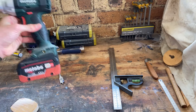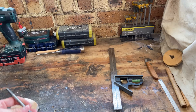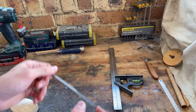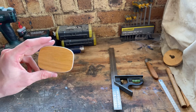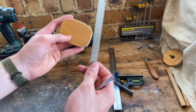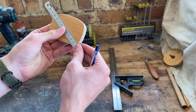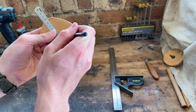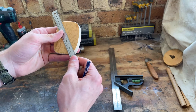One tool I forgot to mention is a drill — you can use a bit and brace if you've got that. I'm using a spade bit, and I'd use a Forstner bit if I had one for a cleaner hole. Next I need to mark the centre point on the fence to drill the hole. I'll use a straight edge and, since this isn't quite square, I'll go across to what I'd estimate are the corners as close to centre as I can — that just puts pencil marks everywhere.